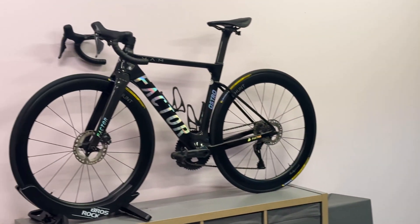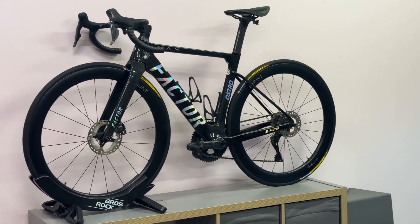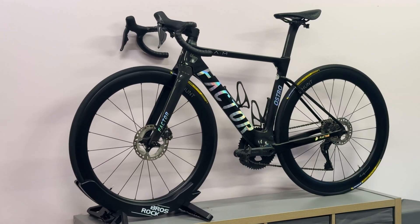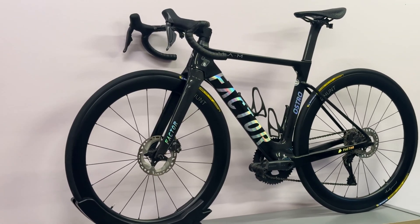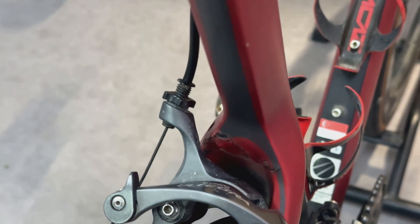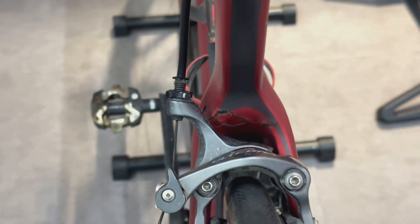But this doesn't confirm whether there is actually a crack — it's just showing that it has been repaired. Correct. How they actually repair it is they file away the cracked portion and relay carbon fiber sheet onto that area. With our technology I can only say that this bike has been repaired before — not whether there's a current crack. After all the repairs, are there any other issues or cracks? There's no other issue besides this. So the thermal imaging scan can show if a frame has been repatched, which you cannot see from the exterior, and it can also detect any cracks. Fortunately this bike has no cracks — it's just been repatched. Just like my bike: there are some paint chips but we don't know whether there's a crack. Jerome, you said you already did a scan on this one, correct? Yes.